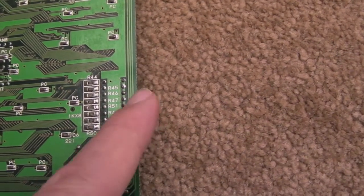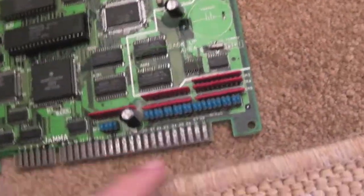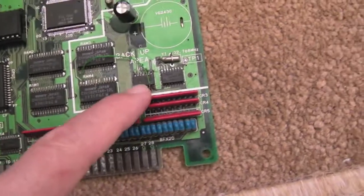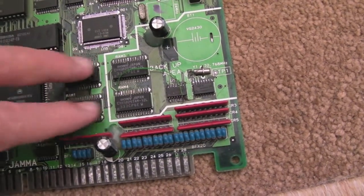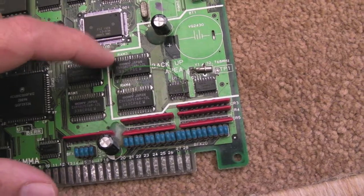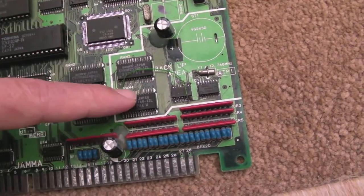They were just lightly scratched but I've tinned them with a bit of solder anyway. Tested continuity. I've also checked the pins on these chips to make sure they're connected to the relevant places, and there was a join there — I think it was pin 7 from the top left on both chips joined — and I compared that to the other boards and that's not supposed to be joined.